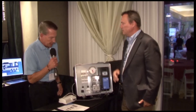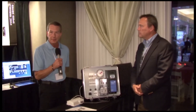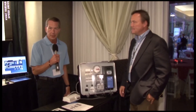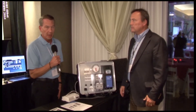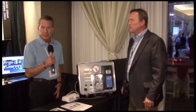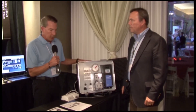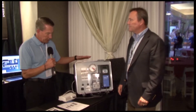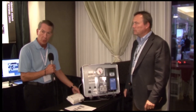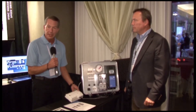Sure, absolutely. Thank you very much. Yes, actually, what we're in the process of releasing now is our Series 2 drive. As mentioned, we've been in the drive business since 2005 with our Series 1 offering. That product's been great for us. We've got probably an install base of 35,000 to 40,000 units out there in that time frame. And just recently this year, we've introduced the VSD Series 2, which I have a nice working demonstration model here. Fully integrated three-contactor bypass communicating to one of our PCG controllers to show the connectivity to the Facility Explorer supervisory controller system.